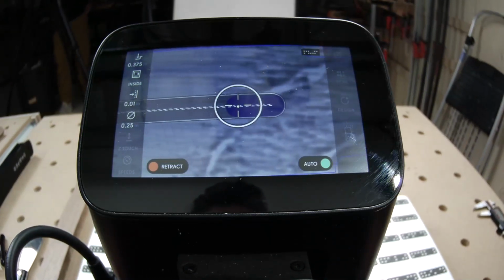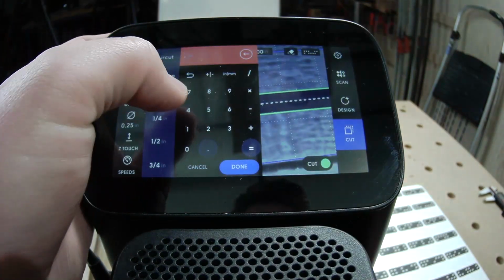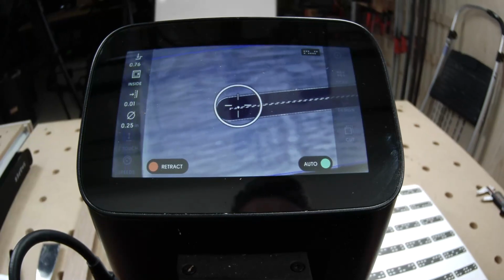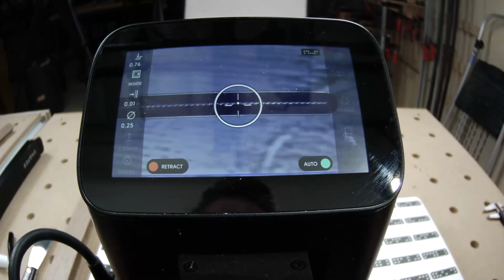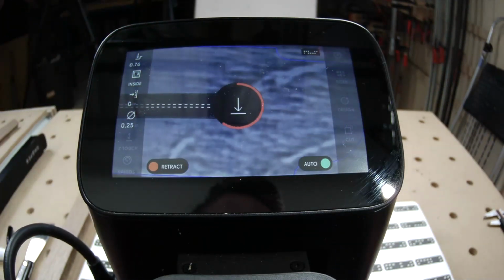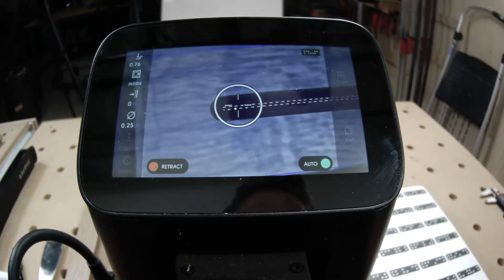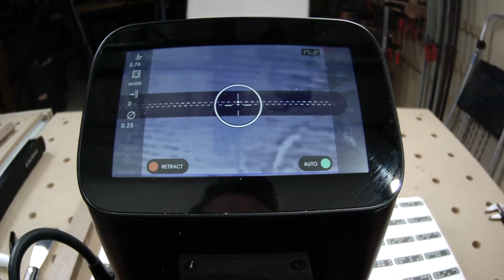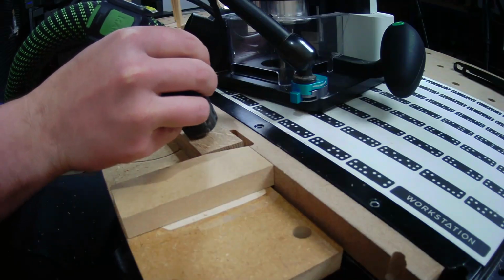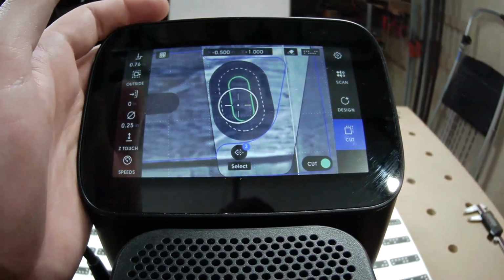Jake is cutting the slot first, as he mentioned, and this is clearance for those thumb screws that allow the adjustability and clamp the pieces of the plant stand together. Going at depths of 0.375 inches per pass on this one. Normally what we recommend is tying your pass depth approximately to the diameter of your cutter. So if you're using a 1/4-inch cutter like we are today, at least as a starting point, start with a 1/4-inch depth of cut. But Jake and I have been doing this for a while, and we know when we can bump it up a little bit. So we're going 0.375 today, just to speed this process up for the sake of time, especially using offsets. That allows you to go a little bit heavier, get maybe a little less perfect line-on-line action for your cut, but then you get to go in with 0 offset for your finishing pass and clean that all up.